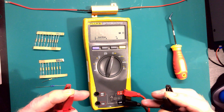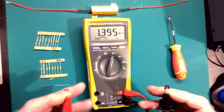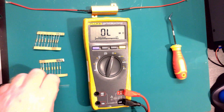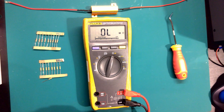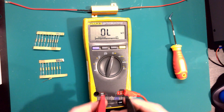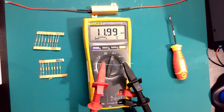Let's try another resistor. The other thing to watch - if I just put my fingers on the probes, you'll see the resistance change like so. You've got to be careful: try not to touch your probes or croc clips because you will get a false reading, as it will pick up the resistance of your body.